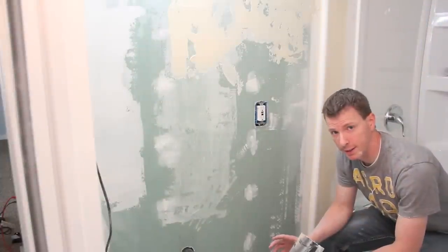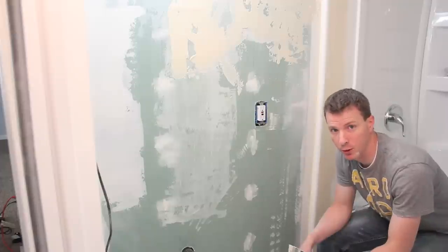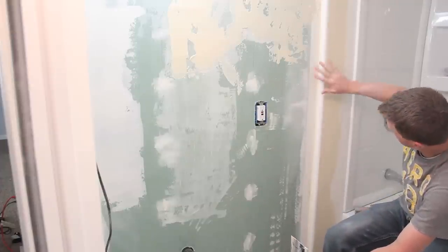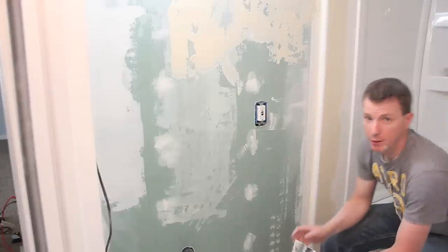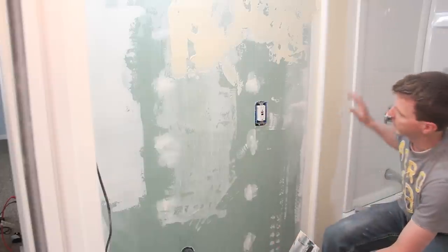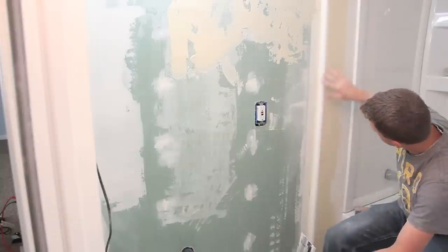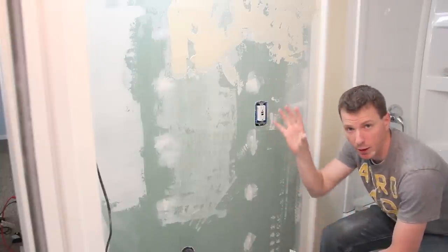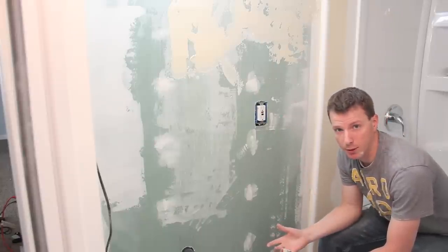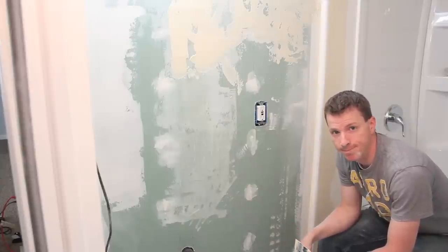When I finished sanding, I grabbed my wide blade again — a 12 inch, though an 8 or 10 inch will do — and started using the topping compound to smooth out sections that just needed a final touch. Keep in mind you can still go back and re-sand before applying the texture, giving it a chance to be nice and smooth so you don't snag or catch on anything. Make sure you get into these corners really well so you end up with a nice, smooth, even corner to run your texture and knife up against. Check out my next video to see how we do the texturing — we're going for a Euro style texture. Hopefully we'll see you there.